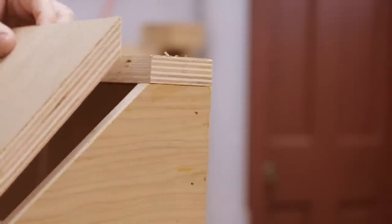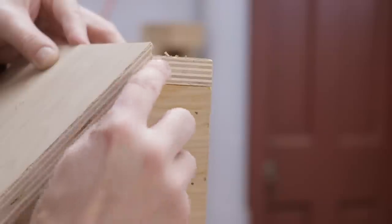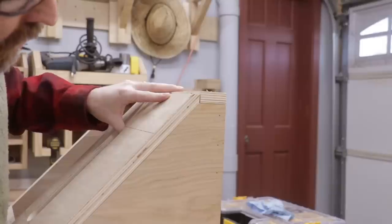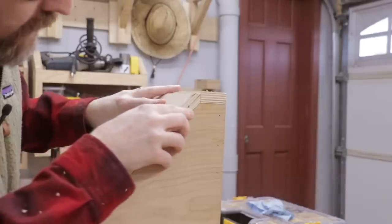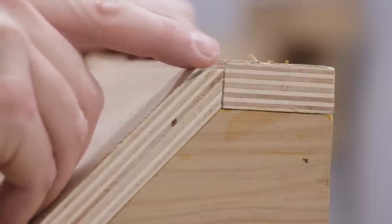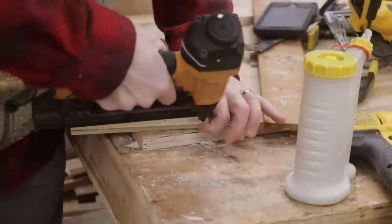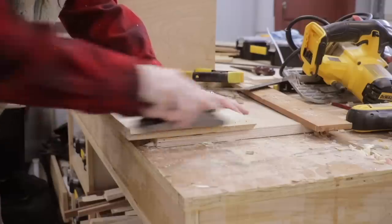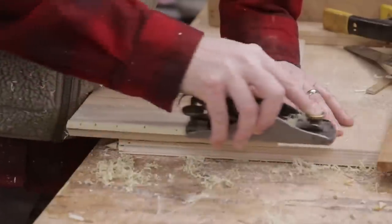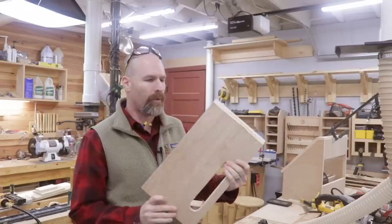The most complicated part of this project is the hinge joint where the roof of the cabinet meets the back — there's a 45-degree angle here and another 45-degree angle to get it flush. Off camera, I tried to cut that angle and didn't account for the thickness of the blade, so I'm off by the thickness of the blade — you can see the step-off right here. I wound up having to cut a piece of scrap to glue on there and take up the width of the blade. Now I just need to flush up that edge where I glued on the scrap piece, and I can do that easily with a block plane. I'm amazed by how often I need my block plane. I'll go ahead and cut the other piece on the table saw, and hopefully I won't make such a mess of it.